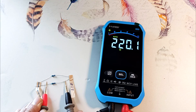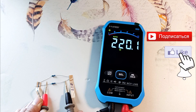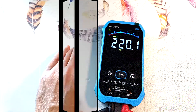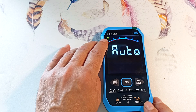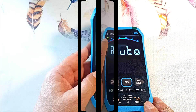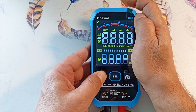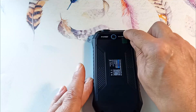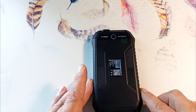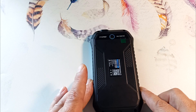You can see the instrument's error for all types of measurements in its characteristics, available in the description via the link provided. There is an auto shutdown icon on the device. Though there is no information about this function in the manual, testing showed the device turns off 10 minutes after the last key press. By trial I found that pressing the left key while turning on the device disables this function. The sound signal in this device cannot be turned off. To disassemble the device you need to unscrew four screws and unfasten the latches, which are quite powerful.